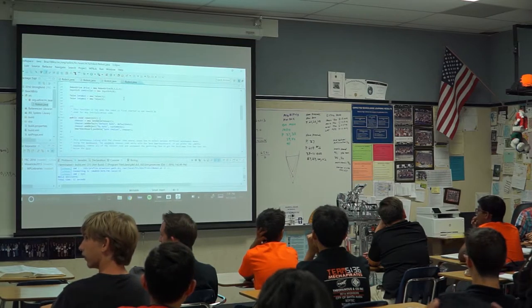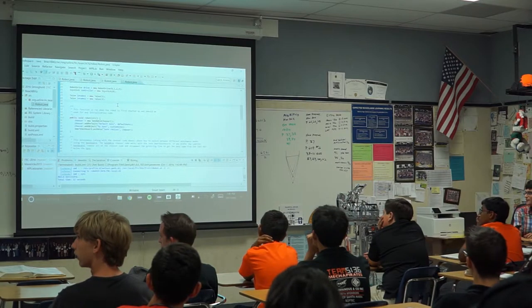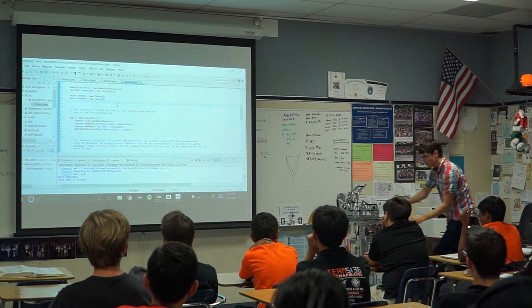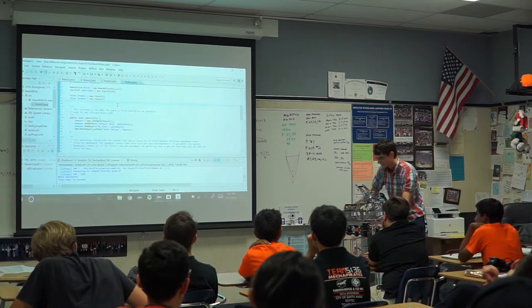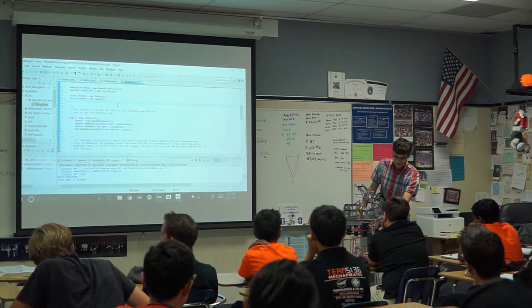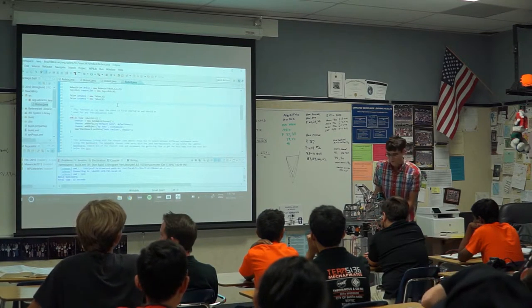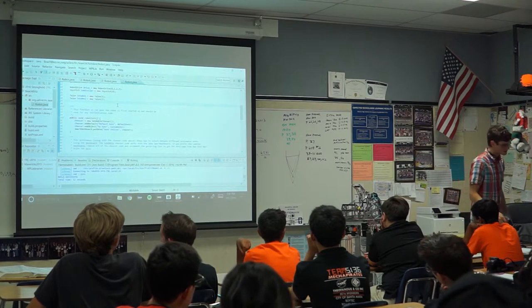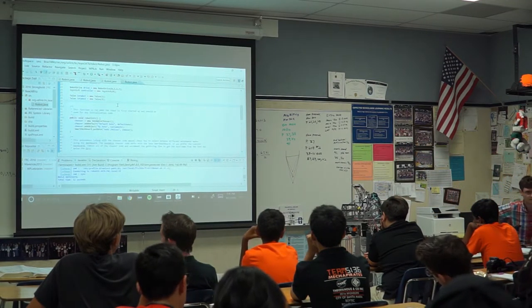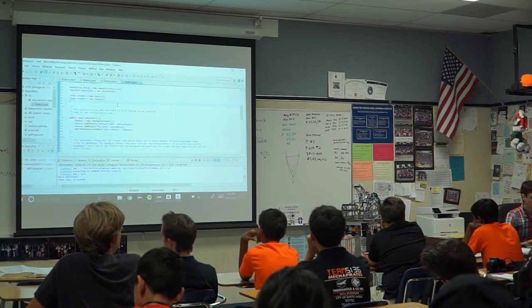So that's what I have. The way we do this, one way, really easily, is through CAN. This thing right here on the back, these smaller controllers, are CAN Talons. They are really fancy. You can see we actually have one of our encoders going into the Talon itself. It runs PID loops really, really fast, like 1,000 times a second. Code runs at 50 times a second, so that's really good. And it automatically does all of that.